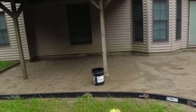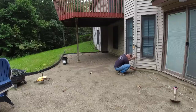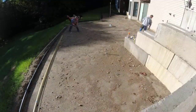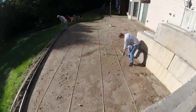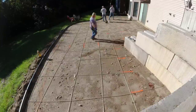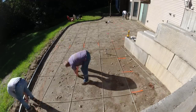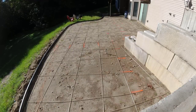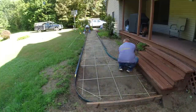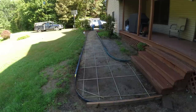What I like most about these forms is the lightweight, how flexible they are, how easy they are to put together, and the learning curve is really easy - very DIY friendly. Now we're putting the mat rebar in here to prep for pour day. We'll use three-foot mat rebar and fiberglass rebar inside, plus fiber mesh in the concrete when we pour. We'll use 4,000 PSI concrete. They're going to have a hot tub in the first section, and we used the flexible forms up top as well.